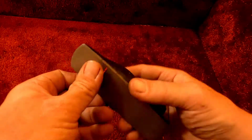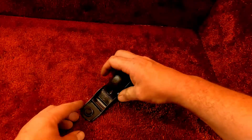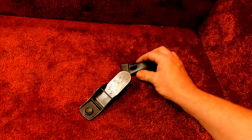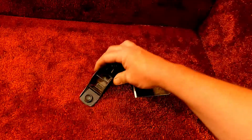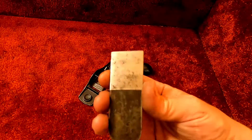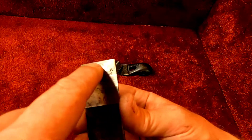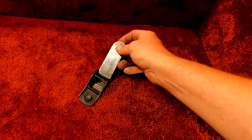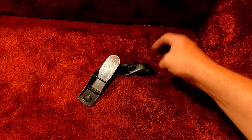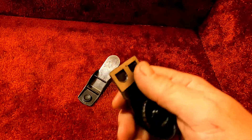It's an old restoration. All I did was lap her out, hone up the iron, and clean up all the areas where metal connects with metal. The back of it has been flattened out — there is some pitting — but we got her sharp and she is ready to make some shavings. The left side is flat also.